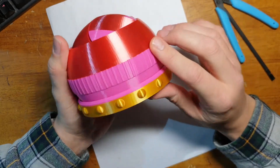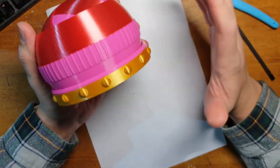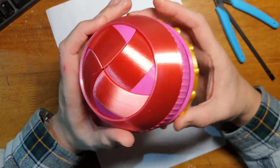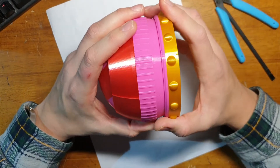It makes such a difference. For all you guys that say you don't need to do a temperature tower — a temperature tower serves more than just as a guide for stringing. It gives you the best temperature for your PLA and also the nicest finish if you get the temperature right, especially with silk PLA. It's not so important with non-silk PLA, but it definitely makes a big difference.